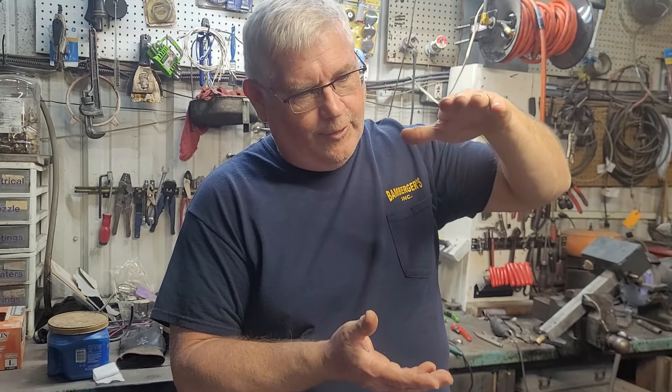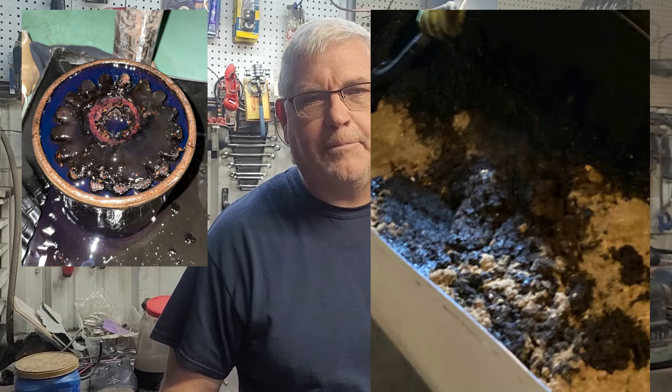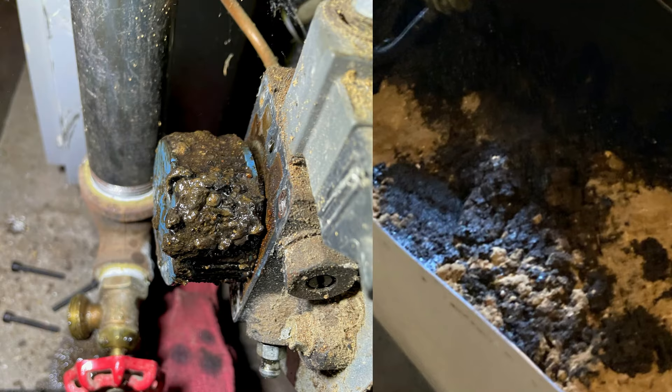You don't want to disturb that junk. So if you leave your tank at a quarter tank, which is probably a foot and a half of oil, when your oil man comes to deliver, the oil won't stir the bottom of that tank. We're going to show you some images of what it looks like on the bottom of those tanks, and it's horrible — it would make a billy goat puke. So don't do it.